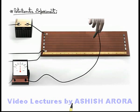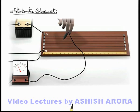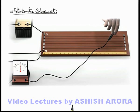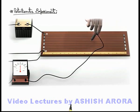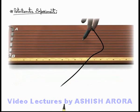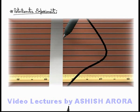When the jockey is connected to the potentiometer wire, at various points we can see the galvanometer deflection changing from left to right. That means between these 2 points we are going to get the null point. Sliding the jockey gradually, we locate the point where there is null deflection. This null deflection length from point A — since this is the 5th wire, the total length is 4 meters plus 56 centimeters, giving a balancing length of 456 centimeters.